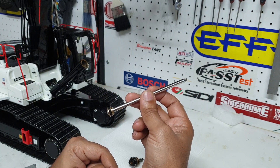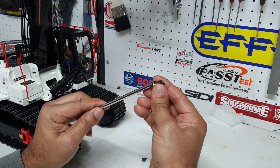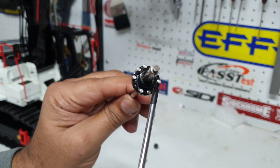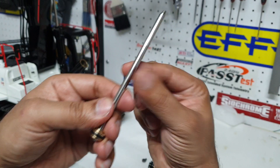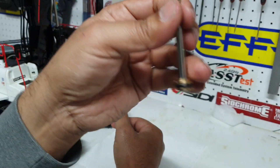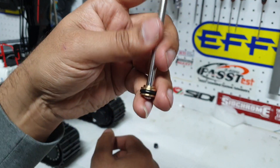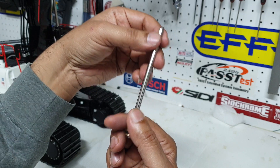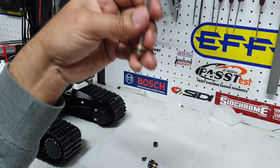This is my Hedromech excavator and I had fine leaks from the top of the cylinder up in this area over here. When I looked closely at the piston rod itself, there were a lot of swirl marks on it. I had to actually get it to a smoother finish so that I could take all the scarring and the marks out, which would then prevent the leaks.